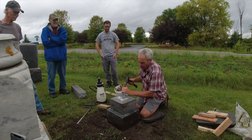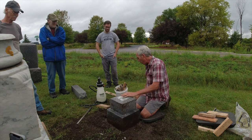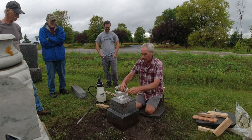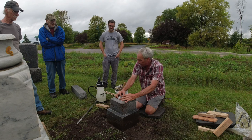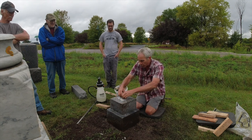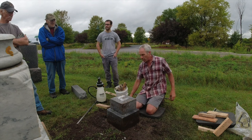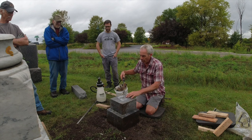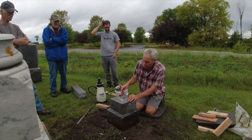Places like Philadelphia, Washington D.C., Baltimore — it's bad. The stones are breaking because the metal expands so much; metal can double, triple in size. It's called metal jacking, or rust jacking, and it'll literally crack the stone — break it into pieces sometimes. That's a big problem in some areas, but I don't see a lot of pin damage here, so that's a good thing.